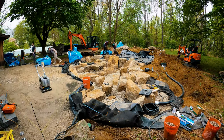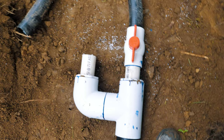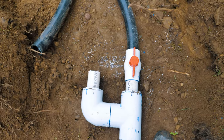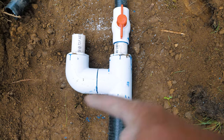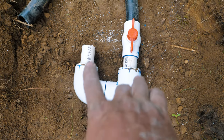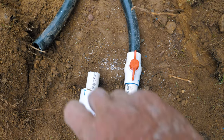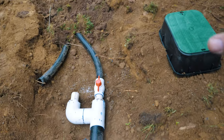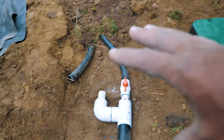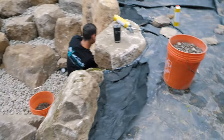Our plumbing is all in, feeding up to the waterfall. Here's where we're doing a manifold. I'm waiting on one bulkhead — it's still on its way. I'm feeding a three-inch into a T and then off into a 90 so I can split this. I'm going to have one line going to the top of the biofalls and one going to the bottom. I can adjust the flow here really simply, and it'll be underneath an irrigation box for easy access. Right now we're just doing our prep work, getting ready to start the pooling area waterfall at the biofalls.